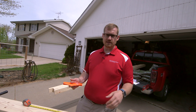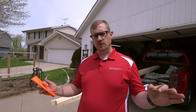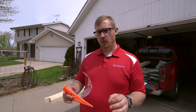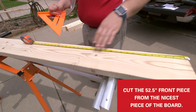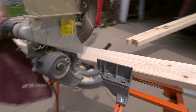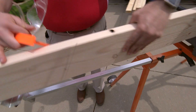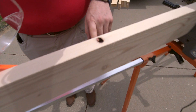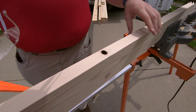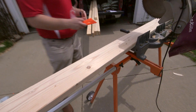We're here to cut our first piece and we're going to cut several pieces out of this two-by-six board — four pieces that are 19 inches long, and then one piece that goes across the front, which is going to be a really nice centerpiece that everybody's going to see. So we've looked at it and identified some pretty good grain here, but down here there's a knot in the board that goes all the way through, and we want to hide it a bit and avoid cutting it into our larger piece. We've pre-measured a little bit already.